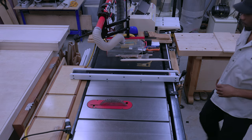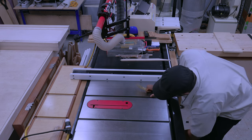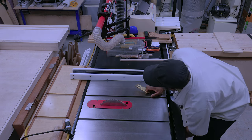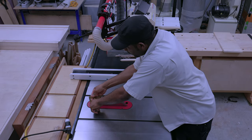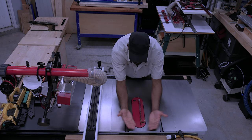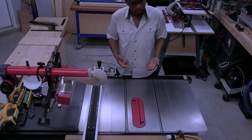What I decided to do is go with a riving knife. The riving knife takes the place of the splitter. The riving knife actually came with this table saw. As you create that kerf, it's going to prevent it from closing in on itself. But I do not have the benefit of the kickback pawls.